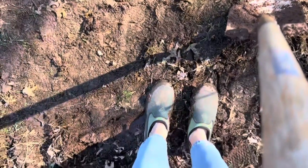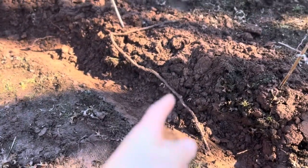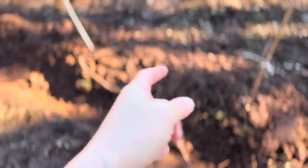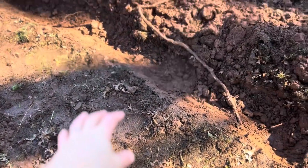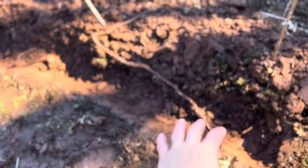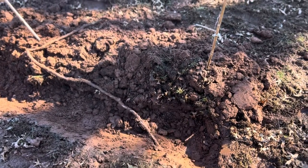When digging, I'm standing uphill. The soil that I take out from the swale trench gets piled on the downhill side. What's going to happen is the water comes down the uphill, it's going downhill, collects in here along with any other sediment, where all of that collects and slowly permeates into the berm below.